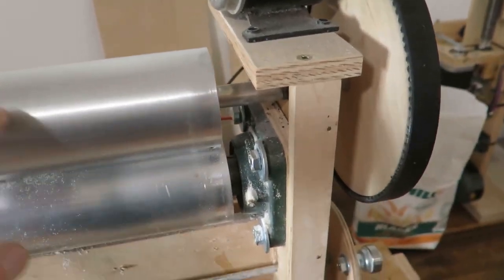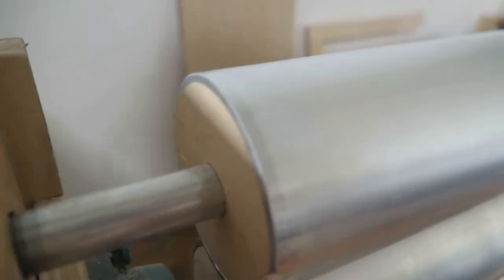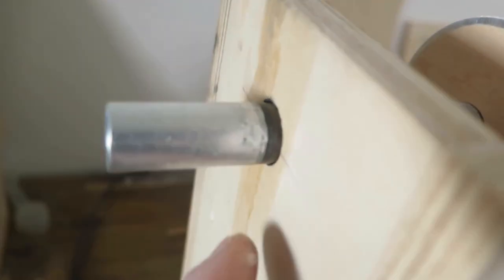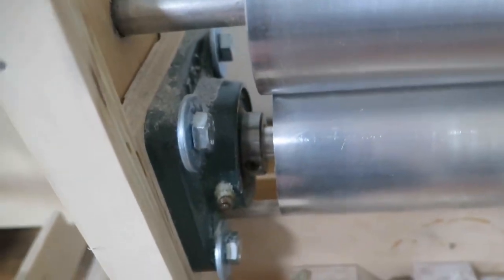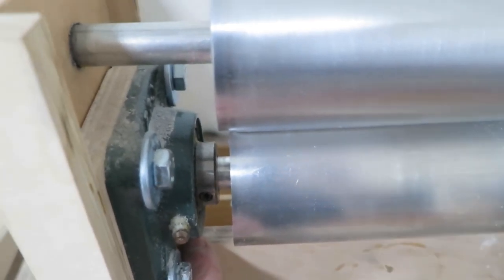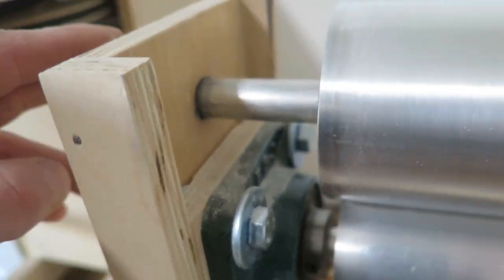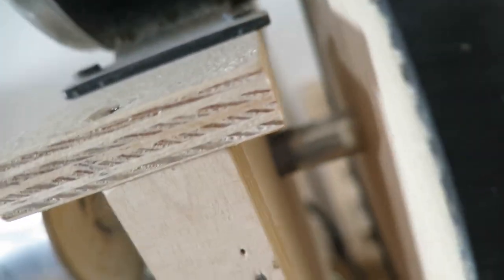So this has two rollers. These are not machined in any way. These have just a wooden insert with a hole. There is this tube. It doesn't even have a bearing, but it's wood. It doesn't really need a bearing that much. This one does have a bearing, and this one doesn't, just because of space. I can't really fit it in here. I could from the outside, but yeah, I could fit a bearing from the outside. Anyway,